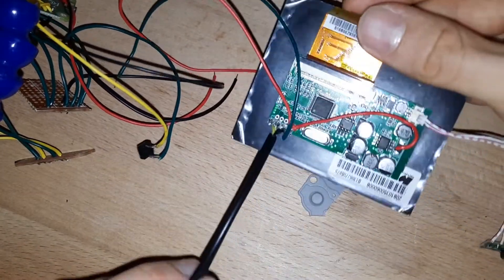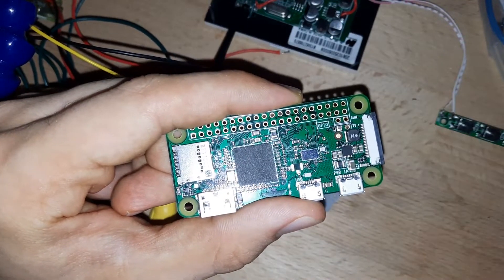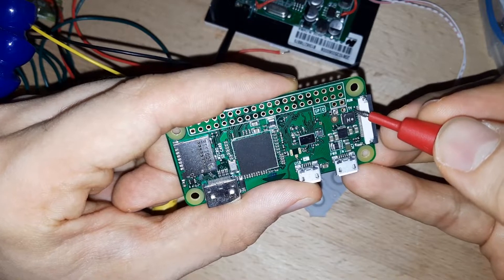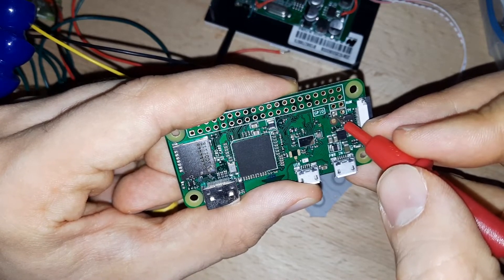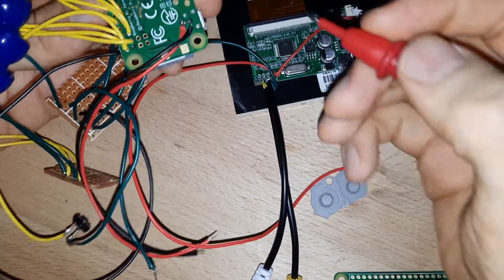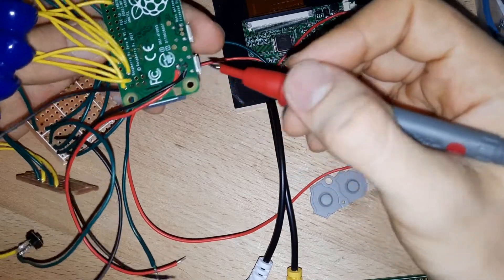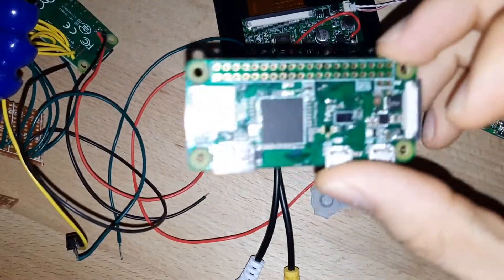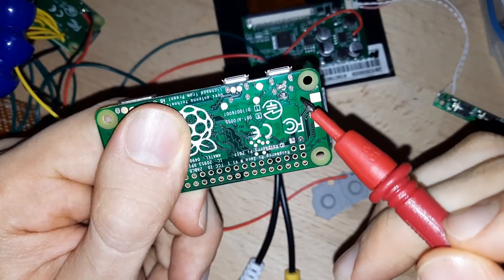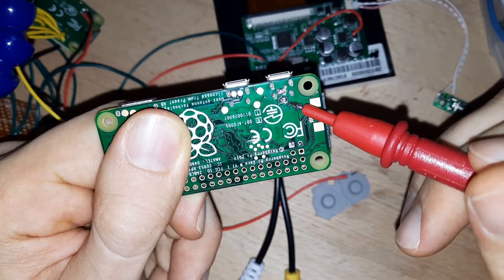In order to attach the screen to the Raspberry Pi, we want to connect the yellow wire from the LCD to the TV pin right here, and the white wire goes in the pin next to it. For power, connect the ground — the black wire — and the red wire to the power USB of the Raspberry Pi, right behind here. So we'll be sharing the battery between the Raspberry Pi and the LCD.